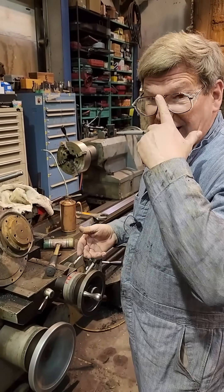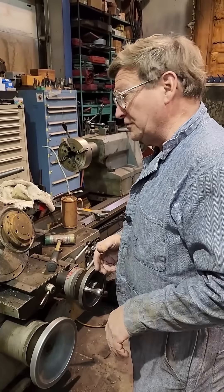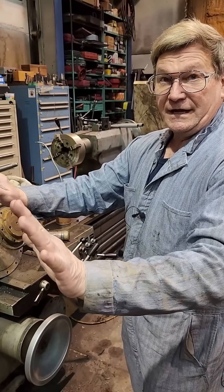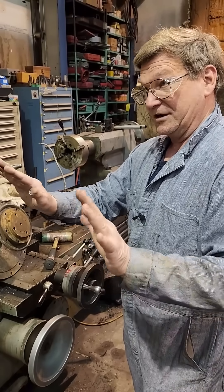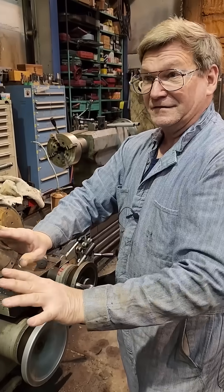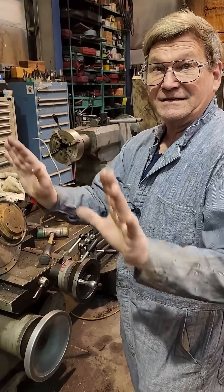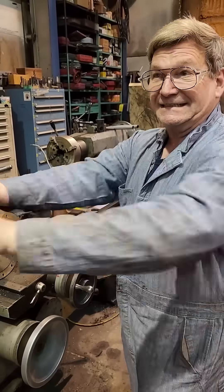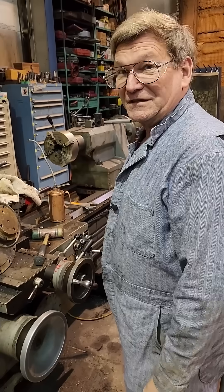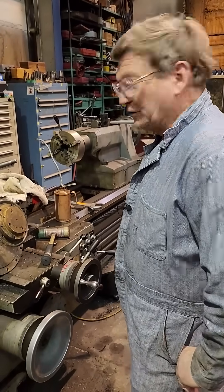When you get these clutches - some of the older Volkswagen clutches are that way, you see that on some of the old Willys, and a few other things - there's a place where the clutch bolts on, and the disc and everything goes down in a well. When you face the flywheel friction surface, you've got to face that ring down too, or your pressure plate doesn't have the same pressure, it doesn't push the same, it doesn't work right. So, a few little things.